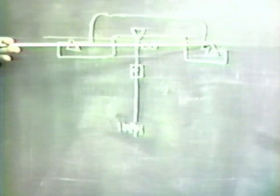For a balance of high precision, where we require that the sensitivity remain constant with load, it is necessary to put the three knife edges in the same plane. Therefore, again, as we adjust the center of gravity to give us the sensitivity that we require, a change in the load will not change position of the center of gravity since it's already established at the three knife edges. This is the type of construction which is used on the HCE models, and it is possible to adjust these knife edges in such a way that we maintain a very, very close sensitivity as a function of the load.